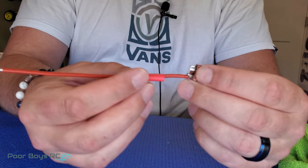So everything that we touched on today — soldering the motor cables on and soldering that Dean's plug — if you're going to be using an XT60, EC3, or EC5 connector, all the same rules apply: put your flux on first, do your tinning, good amount of heat, and be patient. If you guys have any questions or want to see me solder anything else, leave them in the comments below, happy to help out. If you enjoyed today's video, please give a thumbs up and subscribe if you haven't already — it really helps a small channel. Thanks again so much for watching, guys. Be excellent to each other. I'll see you next time.